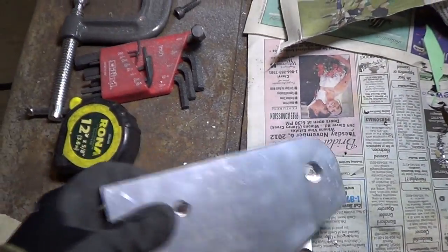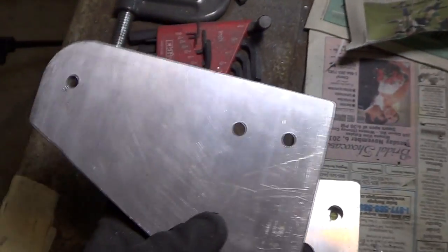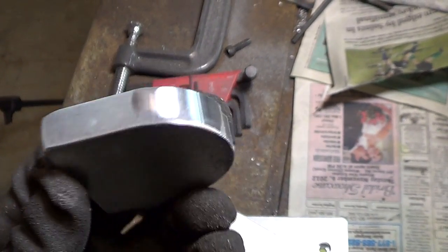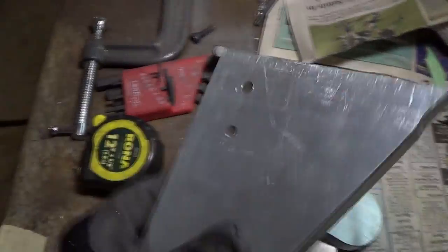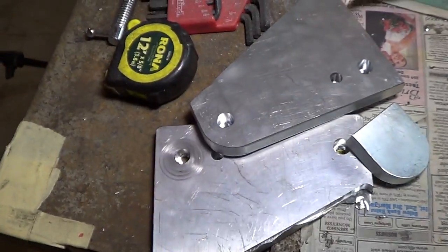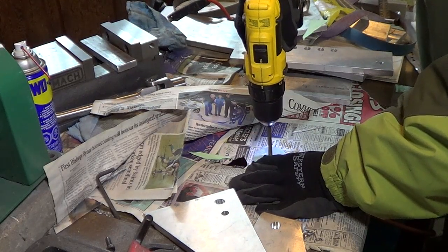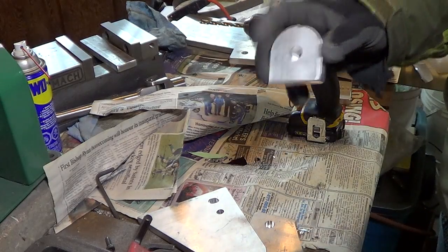So what I'm doing now is drilling out these holes here. Since we used the vacuum pallet, we didn't go all the way through. As you can see, there's like a half-inch hole with probably 20 or 30 thou of metal in between. So I'm just taking whatever drill bit I had in the chuck and running them through. I've already done the other ones, so I'll just show you this little one here — handy dandy table with a hole in the middle. That was a thick one, but it was easy peasy.